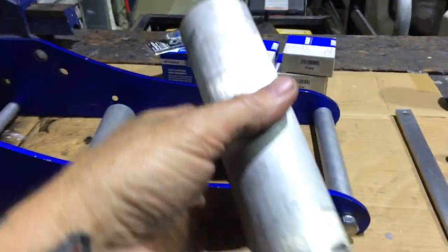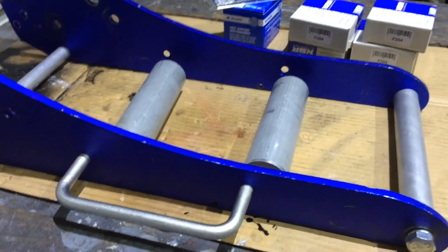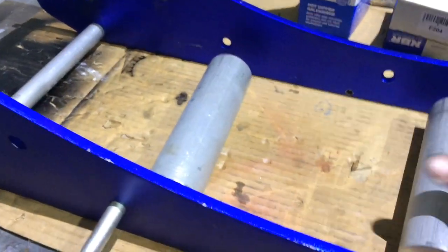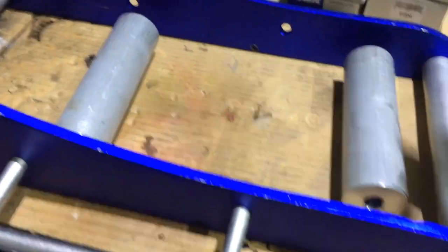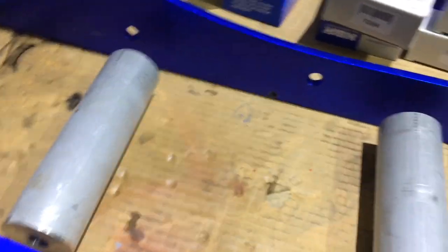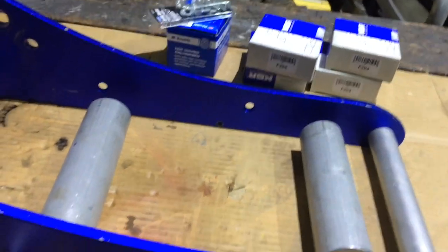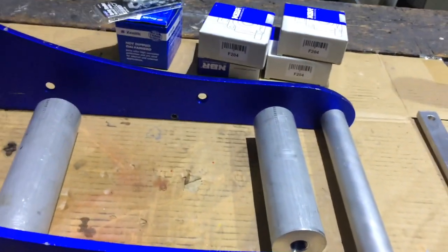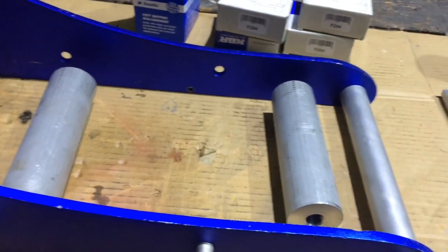I am going to go and price a couple. I'm going to buy four high tensile bolts — M18 by 1.5, probably 100mm long. And I'm going to screw them in there full up tight, mount all this stuff, weld these on, one on each — probably on this side. The thing with the impact gun is you can go backwards or forwards. With a starter motor you can't do that. It's getting there. I'll just go and hunt down some bolts.